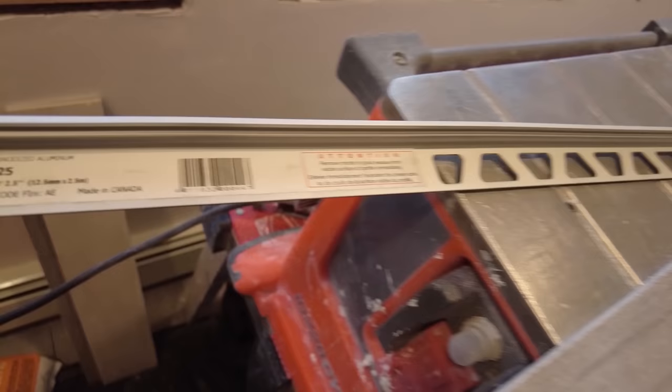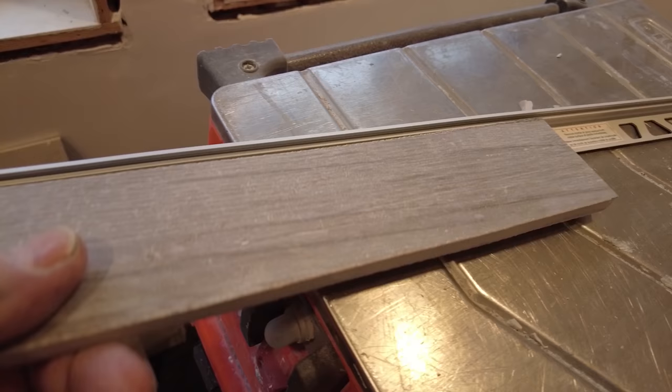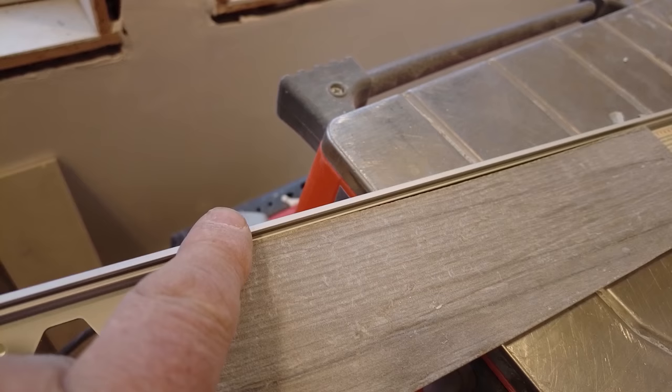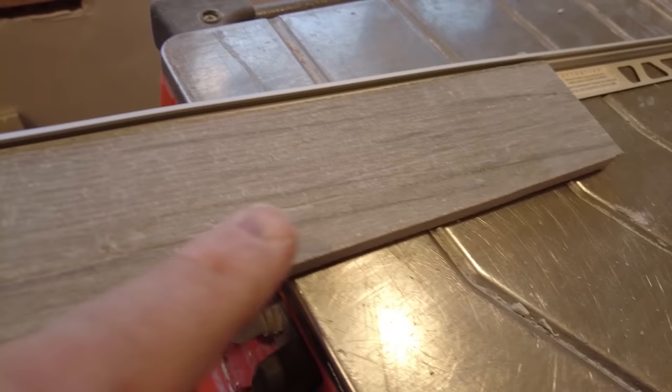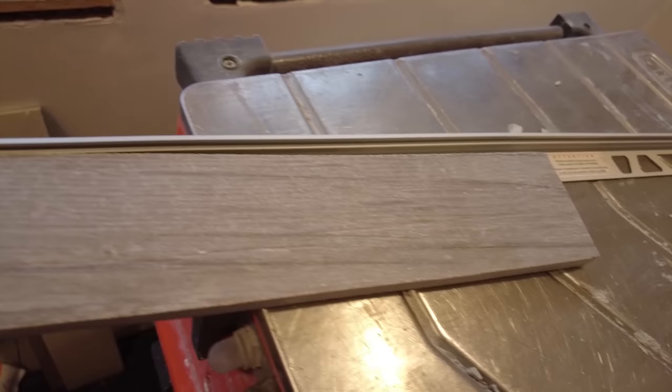And the reason you do that is because you're going to have Thinset under there, and you're going to struggle to try and keep the top of the tile even with the top of the edge, because you've got Thinset and it's going to build it up. So on these large format tiles, if you get a 1/2 inch metal instead of the 3/8 inch, which matches the tile exactly, you're going to be much more easily able to get that edge to be exactly right.